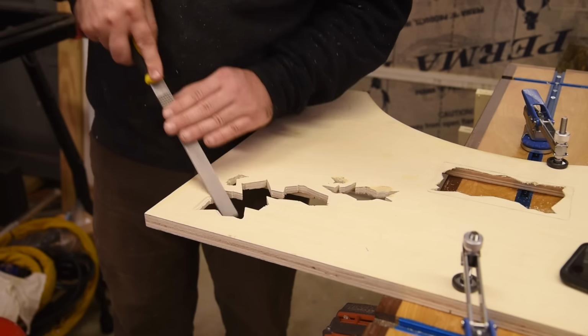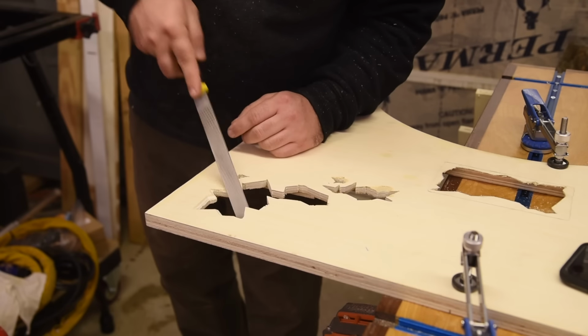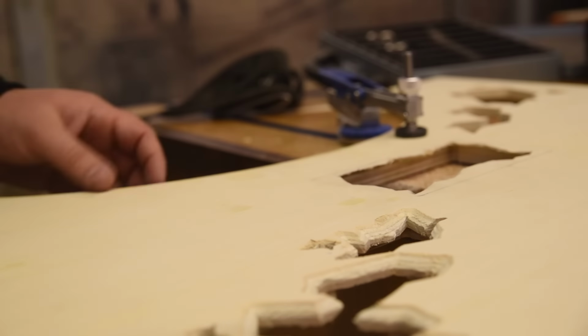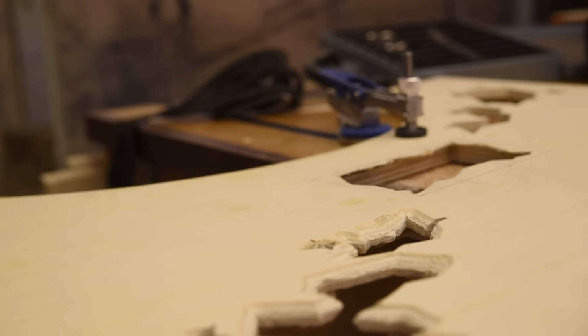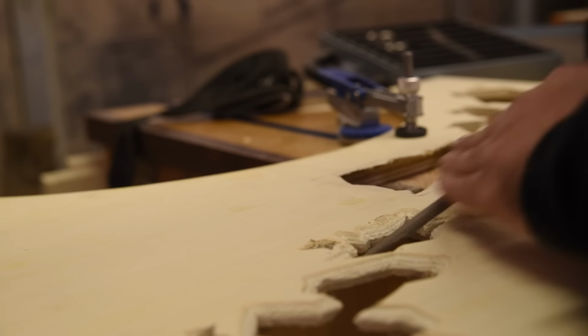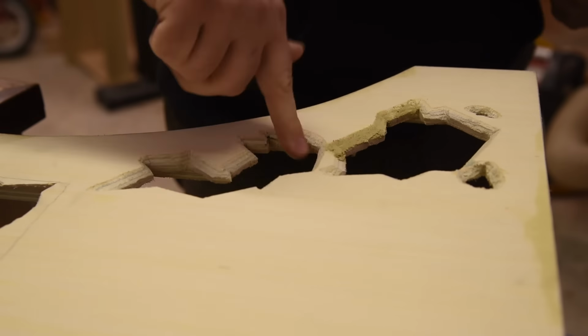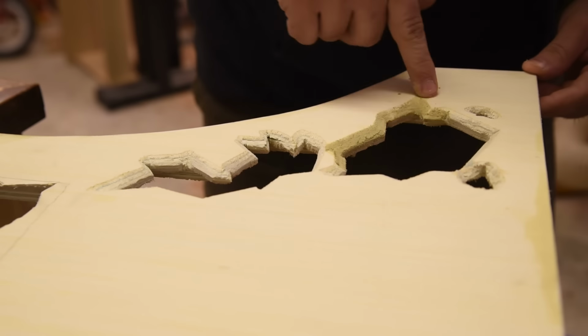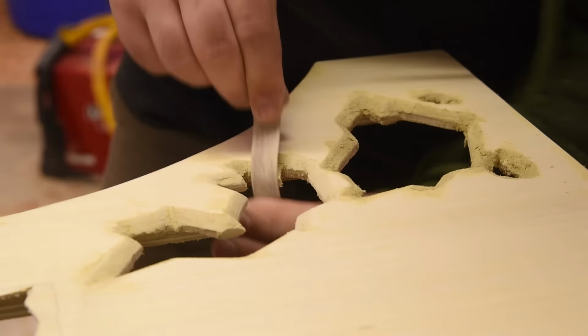Some of the Lego inserts I built with double width bricks and some with single width bricks. The single width bricks have a lot more wood between them and the outside, and the reveal holes there just didn't feel right. So I took a rasp and files and added a bit of a chamfer to them. But plywood doesn't really care to be rasped and filed, so I came back with wood putty and sandpaper to literally smooth things over.